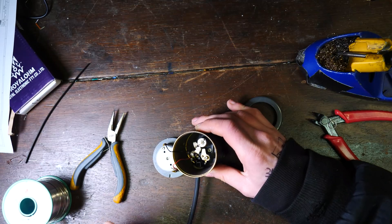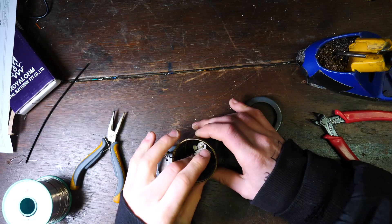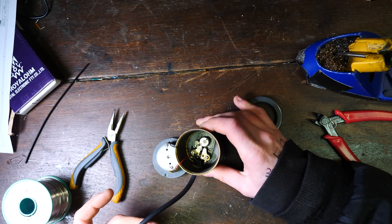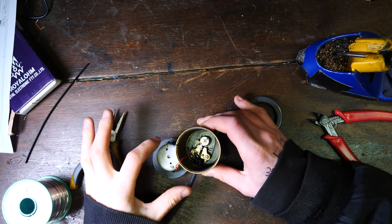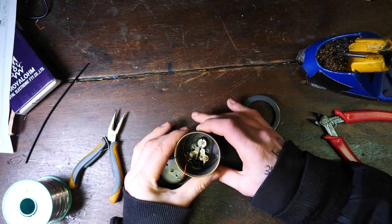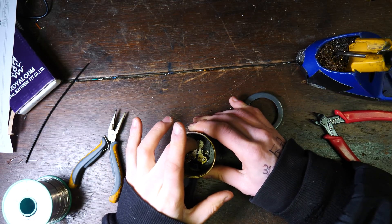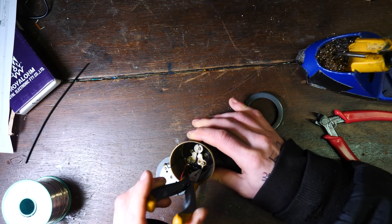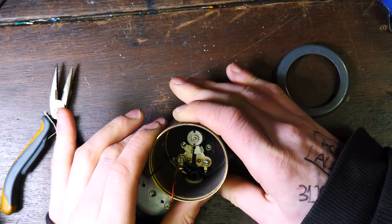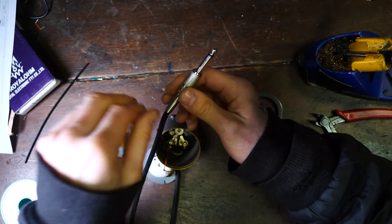The modification is actually done now. I've added a cable tie quite tightly onto the end to act as a grommet because I haven't got a spare one. Basically I've just wired it up so the connections of this guitar cable are plugged into each side of the microphone, which is right here. There's a switch in between which makes it slightly more complicated — this red wire goes from here, up into here, and then into this part. There's a tiny turret right there which I've soldered the hot end, the tip of the guitar jack, to.